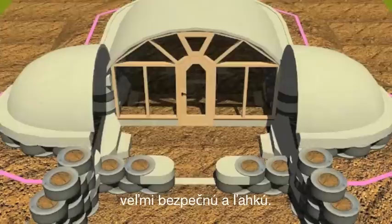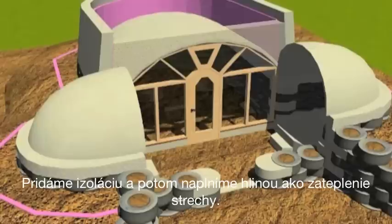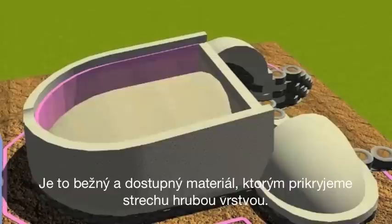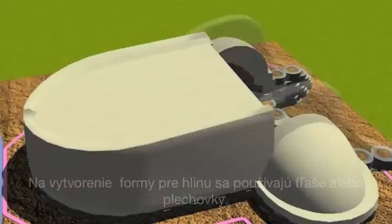Next, the masonry work of aluminum cans goes up around the vaults with a batter slightly leaning in, and a wrap of insulation, then filled with dirt for a very simple thermal roof detail. This allows a plane of earth on which to pour a slab, giving us a basic slab roof. We usually put insulation down depending on the climate before we pour the slab, and the slab will then drain into the cisterns.